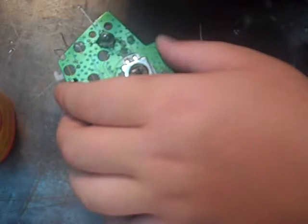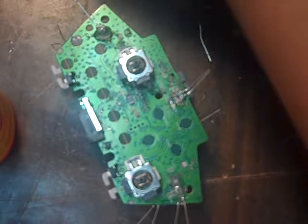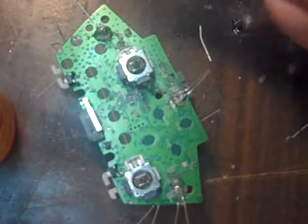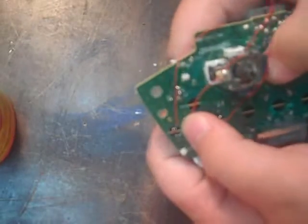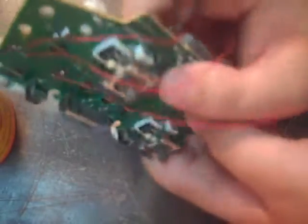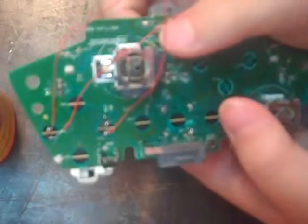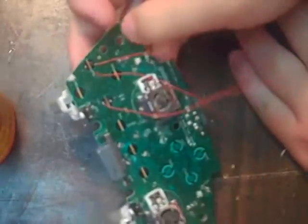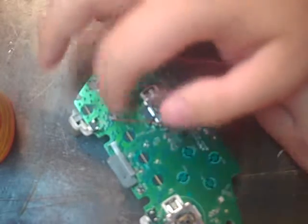Now you're going to take flux and you're going to flux it. This is going to be a drop shot mod. Then you're going to take some wire. Here's one I already did. I'd rather hook it up to where the B button goes. I already started getting the reload mod done. This is not a good version of it — we at FrostMods offer a better reload mod with the chip and it works a lot better. But if you mess up, you can ruin your B button or X button.